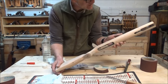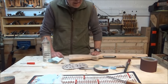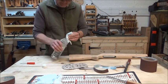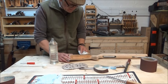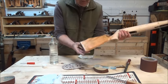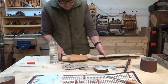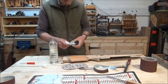There are no shortcuts if you want to do a proper job - it's all hand sanding. I'm seeing quite a few pigtails all over this stock. I'll wipe it down with some white spirit and then show a better close up, but like everything in life whether it's shooting, fishing, or restoring stuff, there are no shortcuts if you want to do a proper job. You have to put the time and effort in. I'm going to wipe this down with white spirit and highlight the areas with a pencil where I need to work on hand sanding, and we'll crack on and get it done.